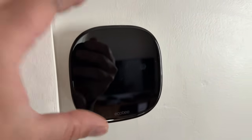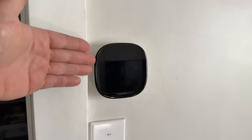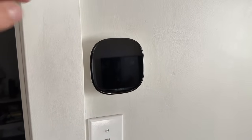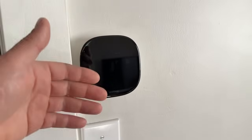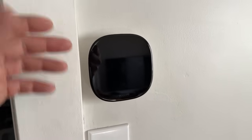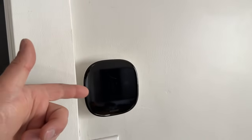Just to confirm while we're waiting — we have nothing at our thermostat, it's just totally blank. There's zero power going to this furnace or the thermostat. That's a common misconception I get asked all the time: if your power goes out, how do you get power to your thermostat? If you get power to your furnace, as soon as you give power to your furnace, your thermostat is going to get power — because the furnace is actually where your thermostat gets power, unless it is battery powered, in which case it's just closing two contacts to tell the furnace to come on.